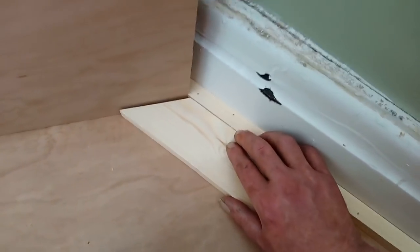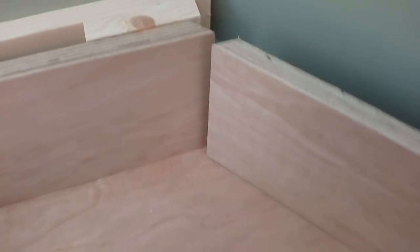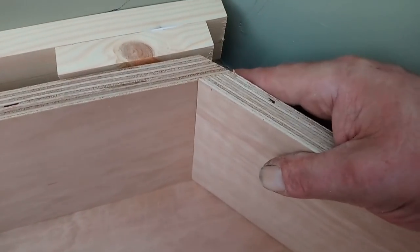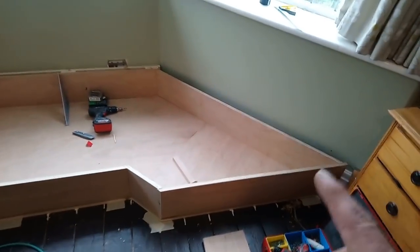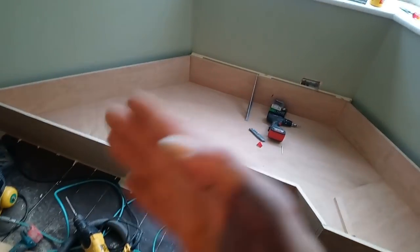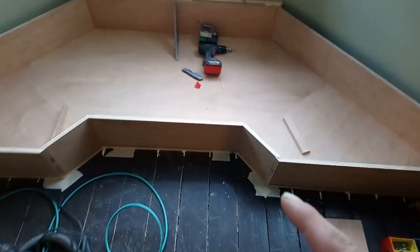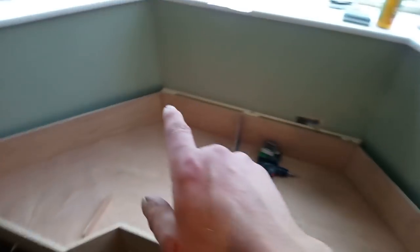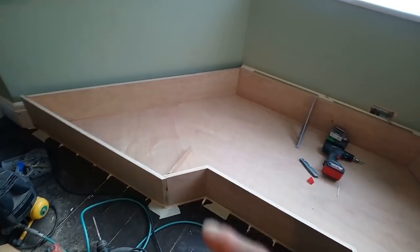I had to get these angles, a cut of timber to that angle. And my saw set at that, so then I can rip a piece off, so then I can cut that. That's not bad. Then I can cut that end. Right, well, it seems that all these joints are the same angle. So while the saw was set, I went around and cut all these pieces. They're fairly good. So now I can get a batten on there, like I did at the back of there. I can start thinking about gluing and pinning all this together.